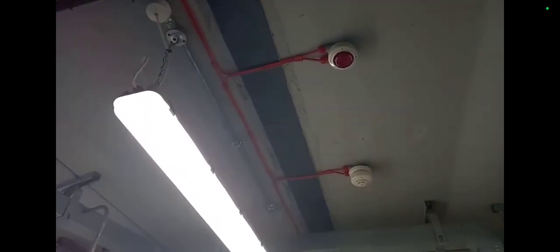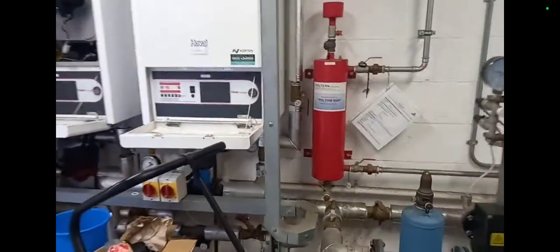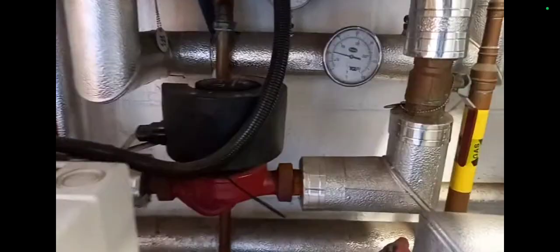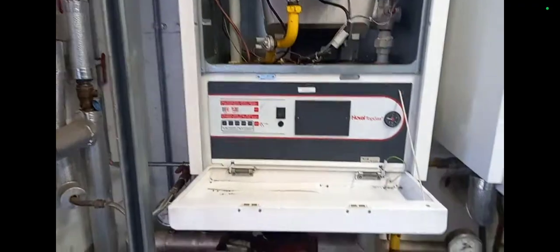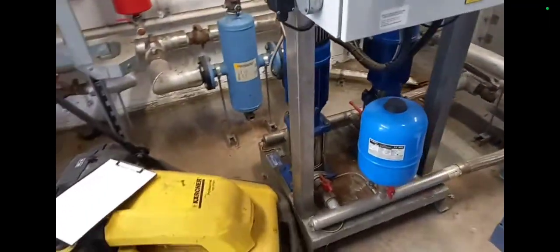There are the fire alarms. Always keep an eye out for these when you're setting off smoke bombs or doing your flue gas analysis, because it can go off especially if you're too close to the boiler. You can see the dosing pot over there on the right underneath the pumps, the different pumps and gauges. There's the old fan - I requested they replace this one as it was blowing the quick-blow fuses. Always carry quick-blow fuses with you. Here's their booster set and behind it you've got a dirt and air separator.